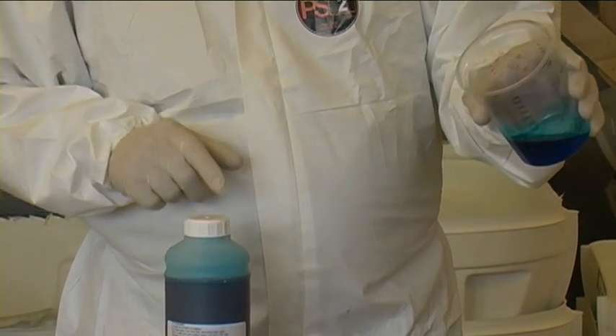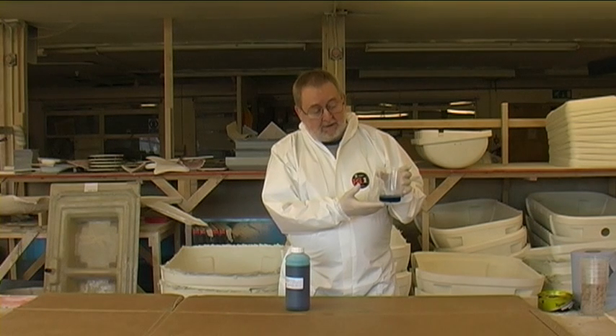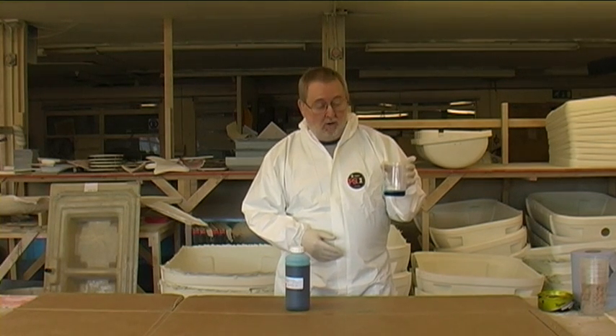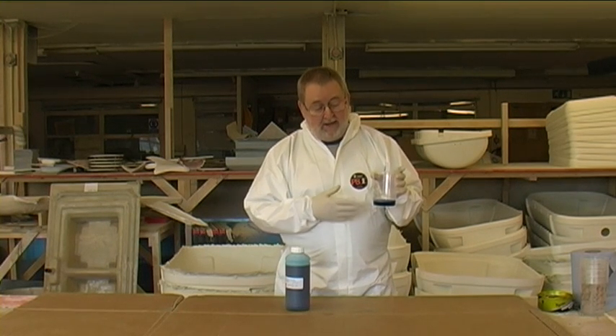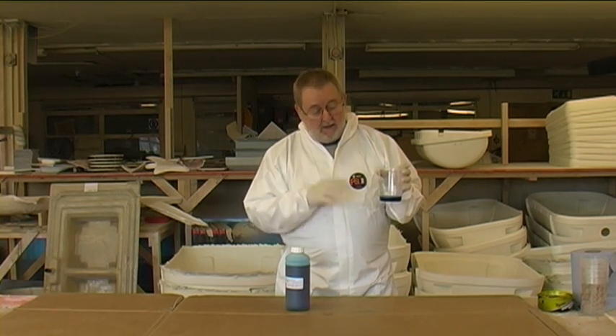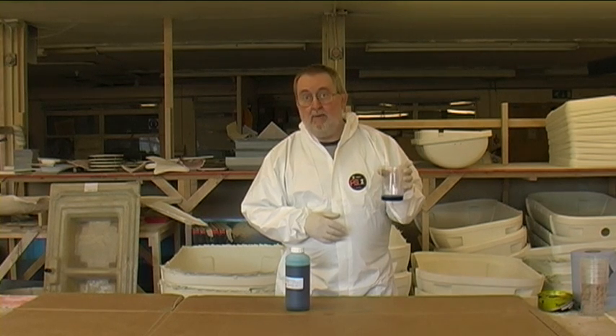This release agent is very reliable. If you get a continuous film over the mould surface then resin will not stick to it. It also has the advantage that it's water soluble, so at the end, when you've separated the object from the mould, it will just wipe off with water. Or, if you're really in trouble and the two things seem to have stuck together, if you can prise a small gap and get water down between the mould and the item you've moulded, then the water will slowly dissolve the PVA and work its way through by capillary action, and hopefully you'll get a release that way.